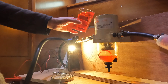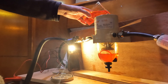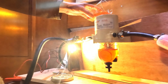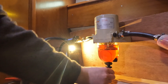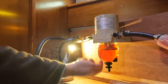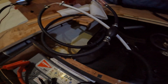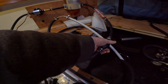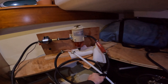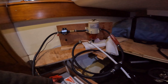Just to help the process along, I'm going to pre-fill this filter here. You want to have lots of tissue ready - you can see I'm spilling just a tiny little bit as it drips off the cup. This tap needs to be physically down, not physically up - you can see the little pattern. I thought up was tight but it's not, so you can see a little bit of a mess. Now I'm going to prime it with the hand pump. You can see it's all been good in that. We're pretty primed.